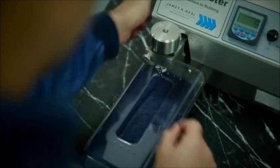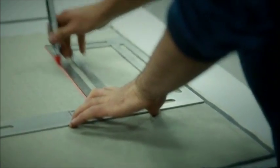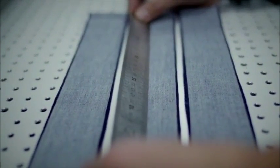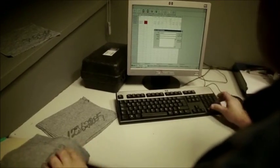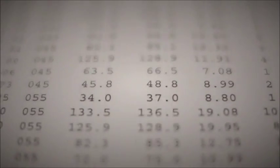At the quality control department, we perform our work with three main control mechanisms: physical tests, visual inspection, and shade assessment. All of this information is then shared with our customers. Physical tests take place on finished and washed products in our accredited laboratories, covering crocking, dimensional stability, tear and tensile strength, and growth and recovery for stretch fabrics. Visual inspection is performed to flag defects and come up with a defect plan. Shade assessment is performed to demonstrate the variations found within the shade matrix of each roll for customer reference. The relevant data collected is compiled into a concise report and shared with customers.